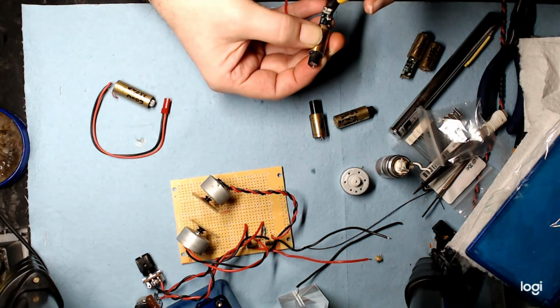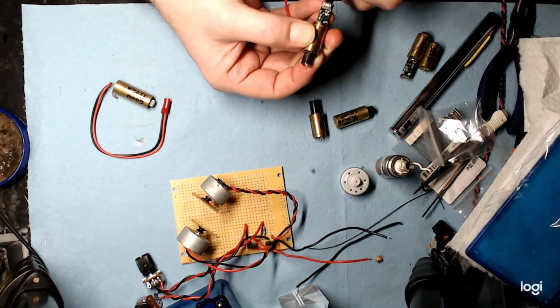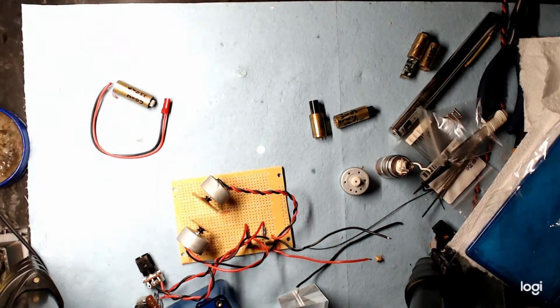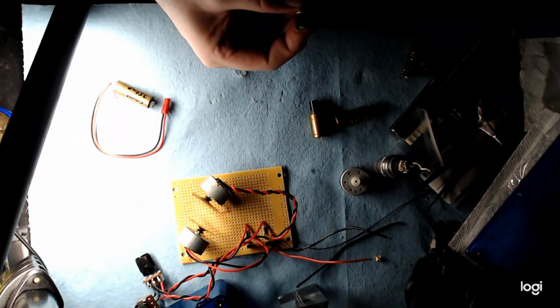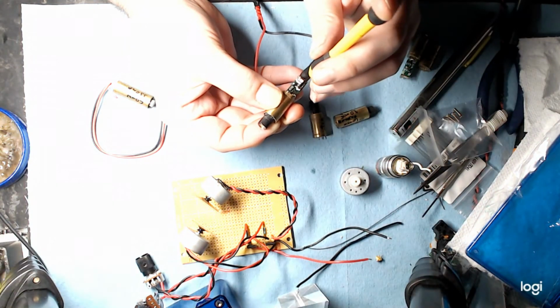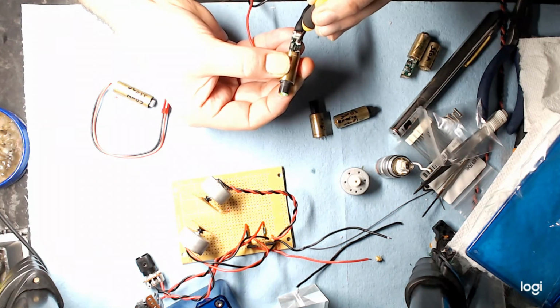Oh, let's see here. It gets tricky holding all this stuff. Alrighty, so we've got that on the wall. Let's back that down. Alright, so now we're at 115 milliamp draw at 4.2 volts. Get this clip back in here. I'm going to dim that out a bit, give you a better idea. So that is a little more the speed that I wanted it at. And we're setting it by the little trimmer.